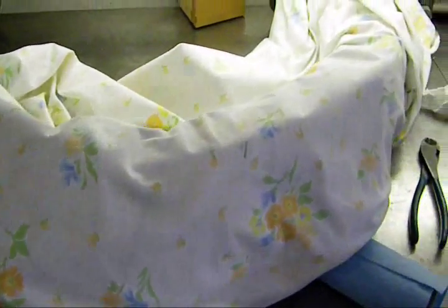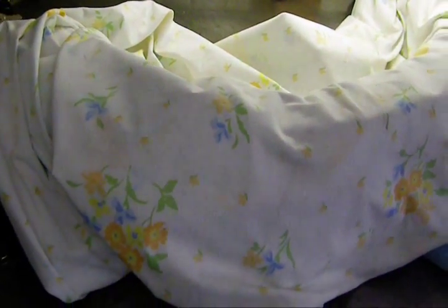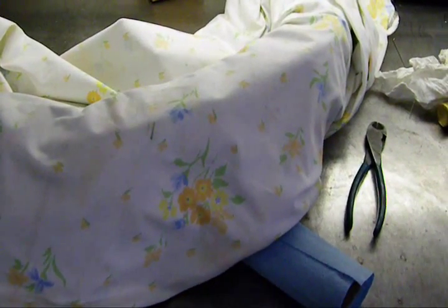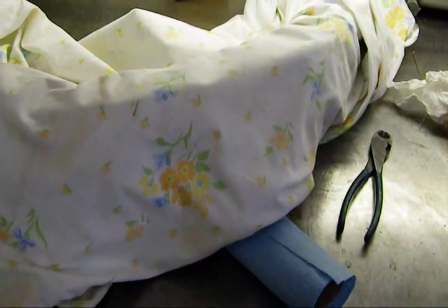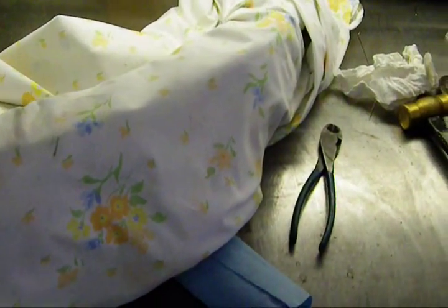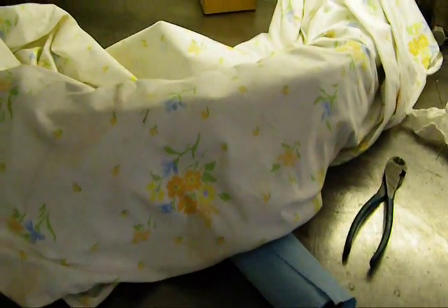I got this thing wrapped up. I'm cooling it right now, slowly cooling it with a sheet or a blanket — there's a blanket underneath as well. I'll let it slowly cool for about an hour or so. Then I'll begin the machining process of fly cutting the top of the flange and cutting in a little bit on the bottom where I welded, so the bolts will fit through. Stay tuned for the machining.